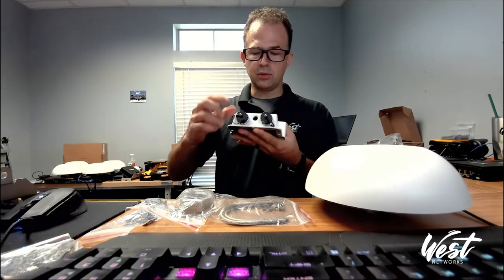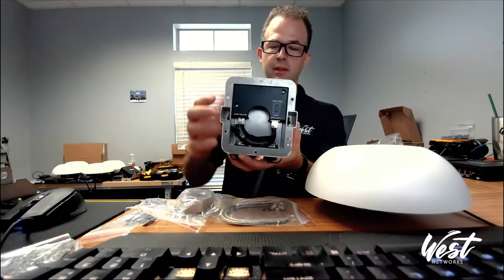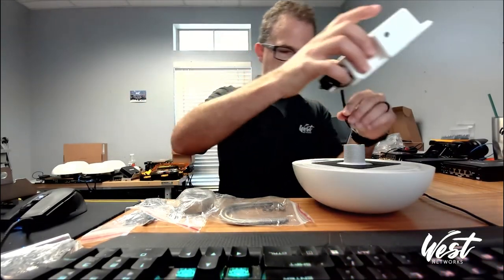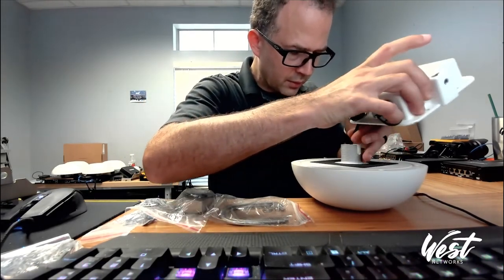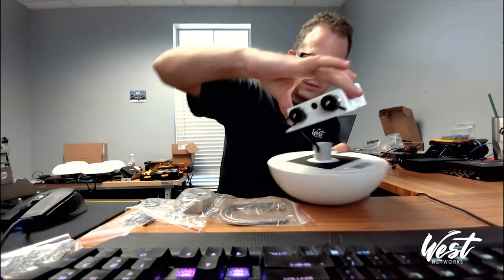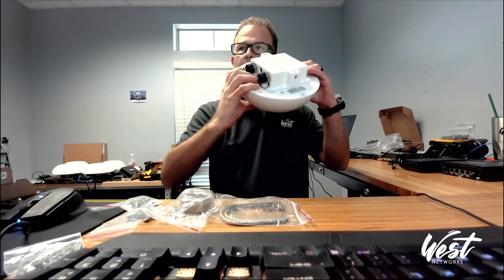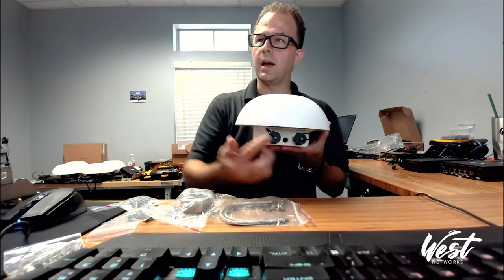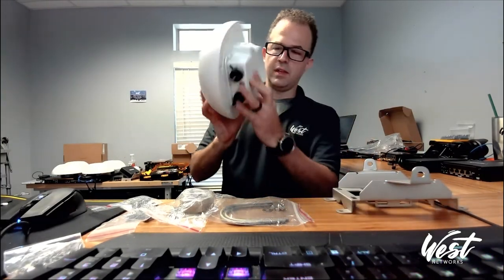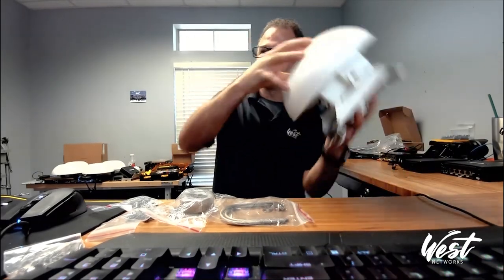The white box allows you to have your LAN PoE input and then your LAN pass-through with PoE pass-through. It has a really cool wiring setup on the inside that allows that. To use it, you pull out the Ethernet adapter, plug it into the router, then bolt it on with the bag of screws. Now I have a different-looking piece of equipment with two Ethernet ports with seals. I can now surface mount this, or wall or pole mount it.